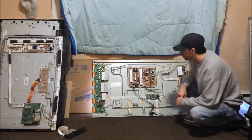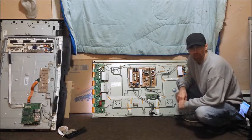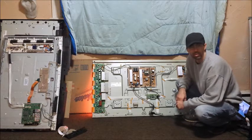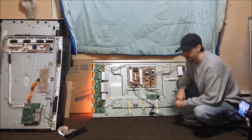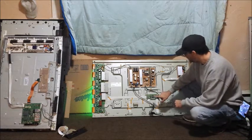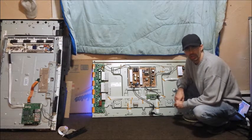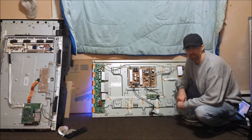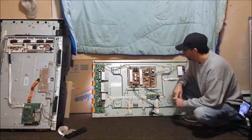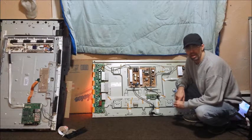I'm not even sure what that code is for, but I have no main board for it. I sold that a long time ago and then afterwards decided I would do the repair or exchange service. So what I have is the logic board jumped into test mode — I'll probably do another video later showing how to actually do that because it's pretty useful. What I end up with is the ability to test the boards and I get to see a test pattern on the screen.